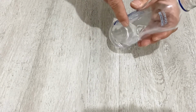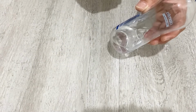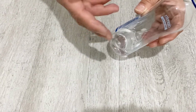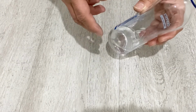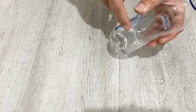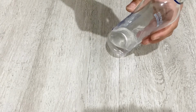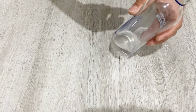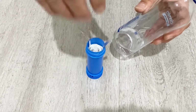We need to use a surfactant to break down the surface tension of the water. So what kind of materials can you use as a surfactant? You can use methanol or ethanol or acetonitrile, but if you have none of them, you can also use dish detergent or dish soap. It will just break down the surface tension of the water and you can use this electrolyte for your supercapacitor with peace of mind.